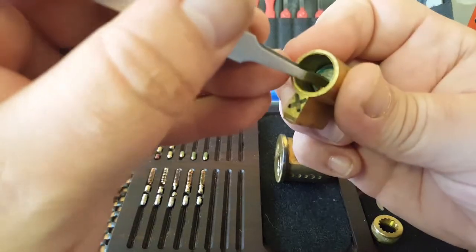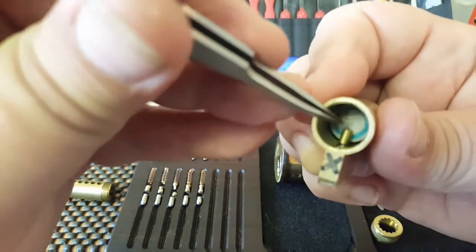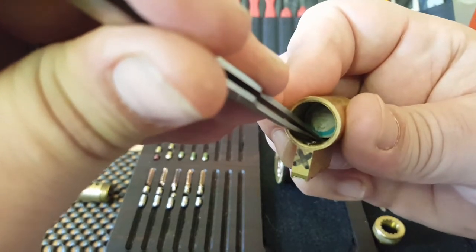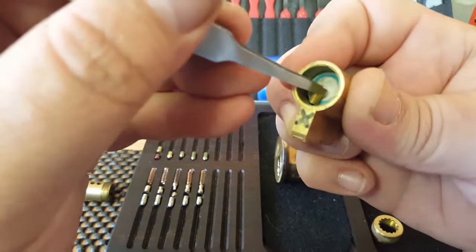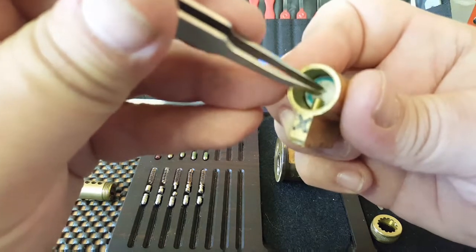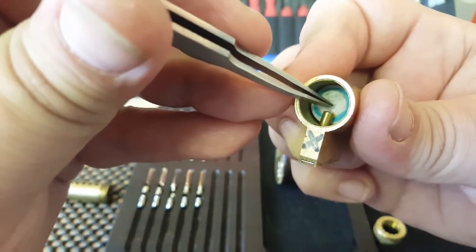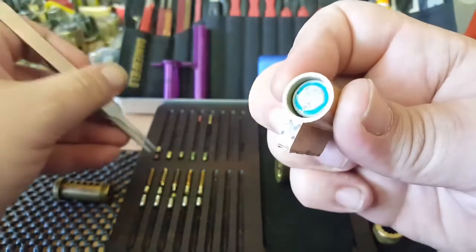And the next one, like I say, oh, that one sprung off, which they can do, but as you can see it there, what we'll do is we'll push it in till it goes flat, and then we push the follower to the next bit. There you go. And the next one, see, it's resting now. Because the spring is just slightly under the shear line, the spring will rest. And you just push it down, push your follower to the next one.